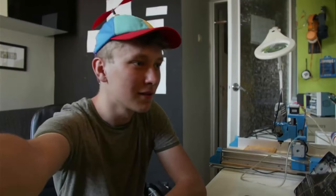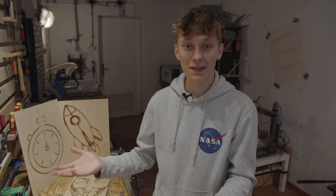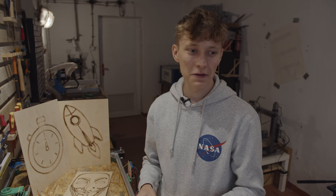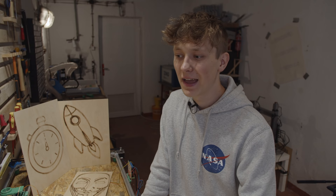Hello everyone, can you hear me? Yes, that's great! I'm going to mill some stuff on the Dremel CNC and this stuff is going to be a PCB. There was a live stream on YouTube of how I'm making the PCB. Unfortunately it wasn't really that great and successful, but after the live stream I tried again with a bit different settings and it was actually successful and the PCB is here. I used FlatCAM and BCNC in order to machine it on the Dremel CNC with a pyramid milling bit.